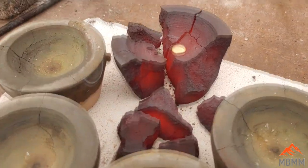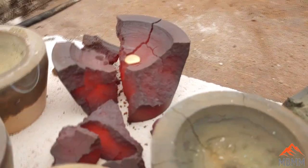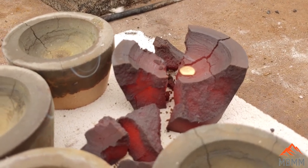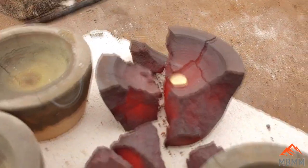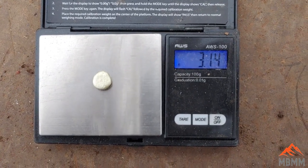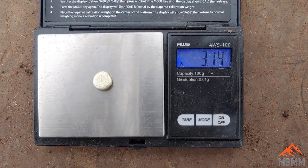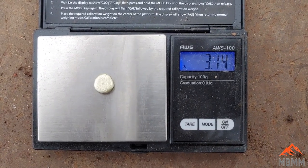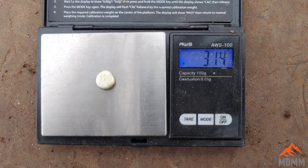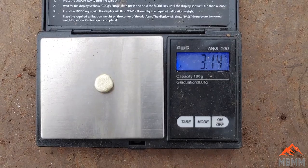Okay, there they are all pulled together, and that cupel broke as well when I got it out, and you can see it's totally saturated. It's gray all the way through, whereas this one on the left still has some of the tan color from the original cupel. So here's all our beads kind of conglomerated into one, and I'll get this set up so we can try and figure out the carat of this gold. It looks like it has quite a bit of silver in it, but we'll get an underwater weight and compare it with this weight, and we'll see what kind of value we have.